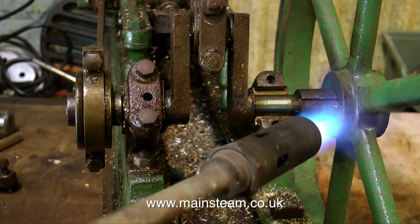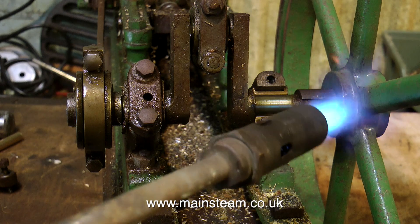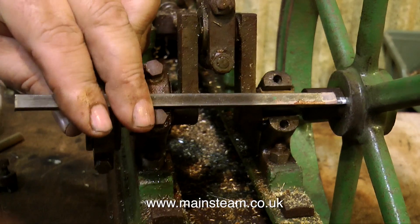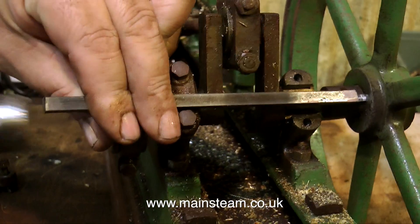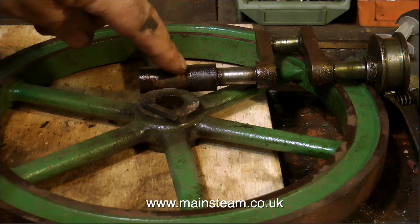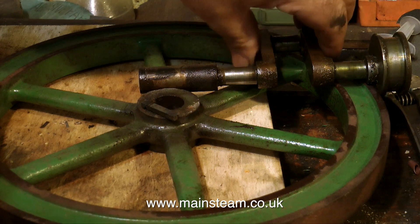Don't go mad if you do this — you don't want it to glow bright red, you don't want to melt anything, and don't set fire to things on the bench. With a little bit of heat applied, you can see the key's coming out quite nicely now. Once the key popped out, it was quite easy to remove the flywheel. There was a bit of rust inside the flywheel which made everything grab together. Finally, I removed the other bearing top cap and the big end, and here you can see the flywheel and the crankshaft. Thanks for watching and I hope you found it useful.